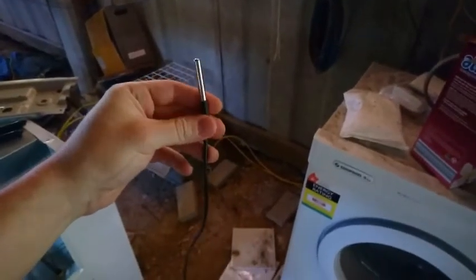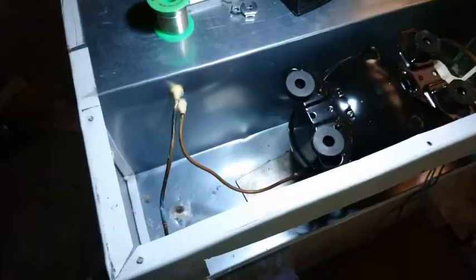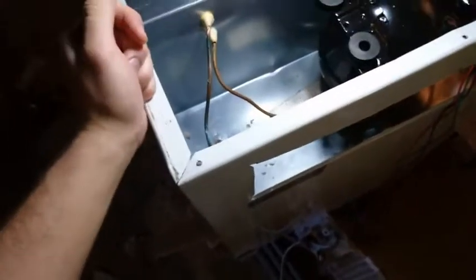I'm thinking of leaving a little bit of extra length on the cable — it's pretty long — so you can tuck it in amongst the food and it'll measure the food's temperature, as opposed to what the original sensor was measuring, which is just the housing temperature.